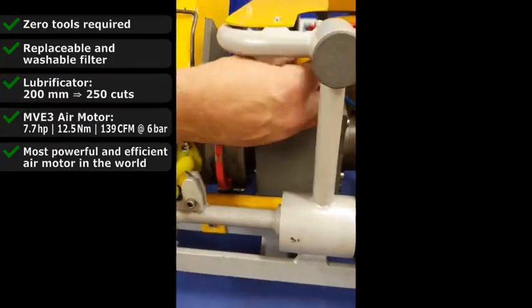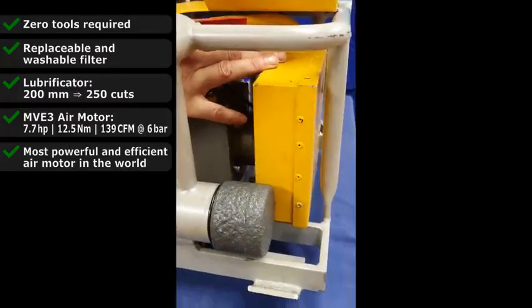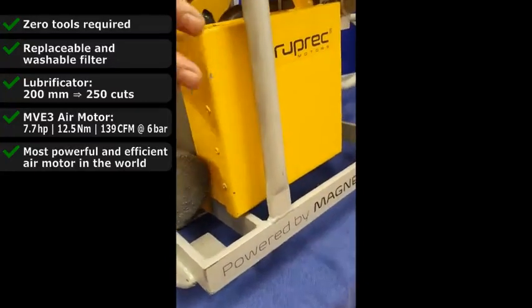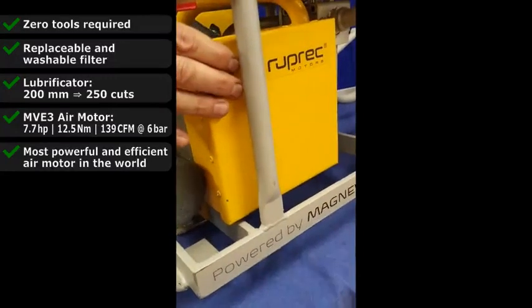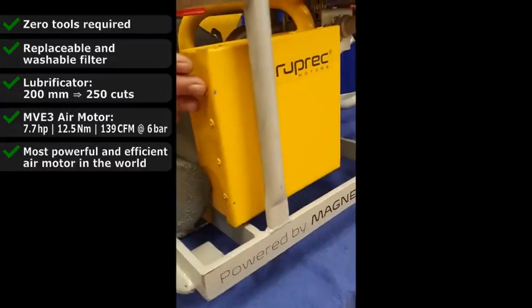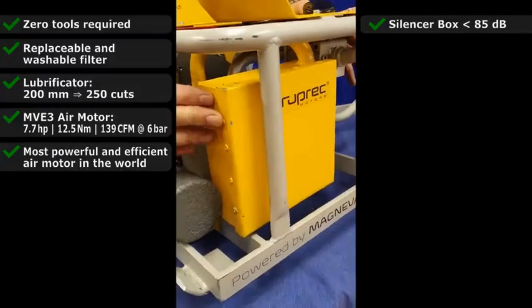The rigid piping from the exhaust goes into an exhaust piping system, feeds into an in-house developed multi-layer cone-plated silencer. The cones disturb the high frequency, the hollow cones disturb the low frequency. This allows Magnevane to achieve 85 decibels at 1 meter behind the operator.